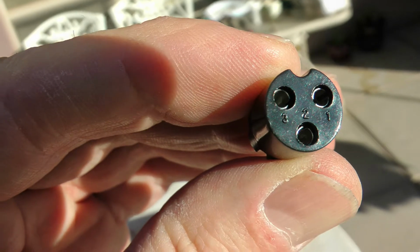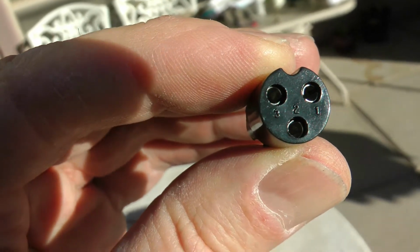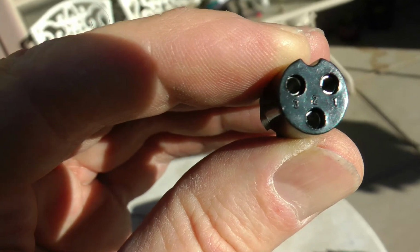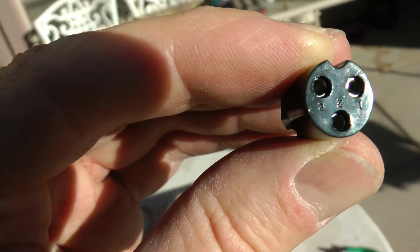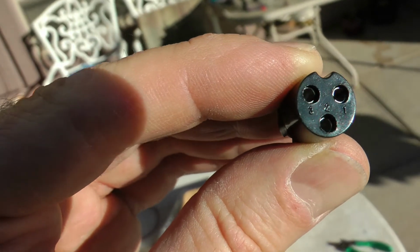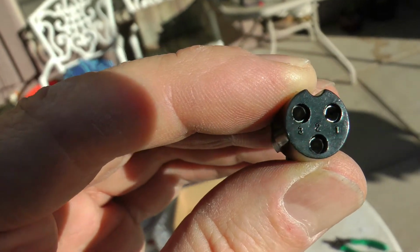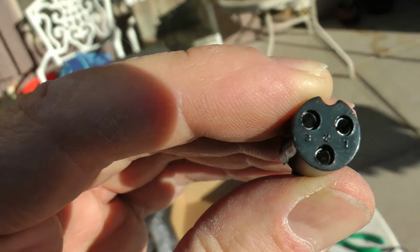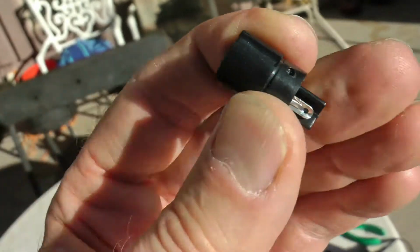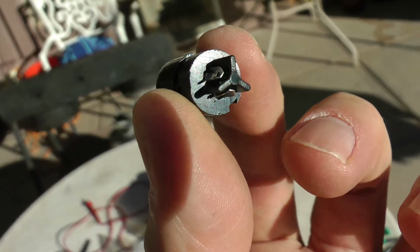Okay, so now I need to figure out on my new connector where I put the positive and negative wires. You can look at the front of the connector and see there's a 1 on the right-hand side, 2 is kind of the bottom, 1 in the middle there, 3 is on the left. Looks just like our old connector from our old charger. So I need to know where to put the brown wire, which is positive, and the blue wire, which is negative, on these connections on the back.